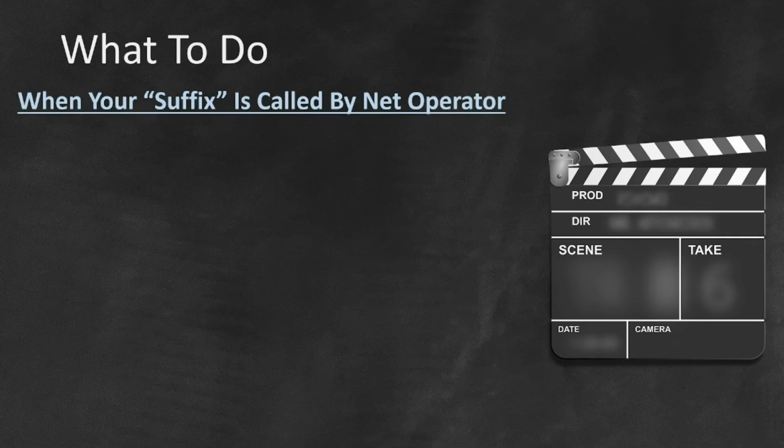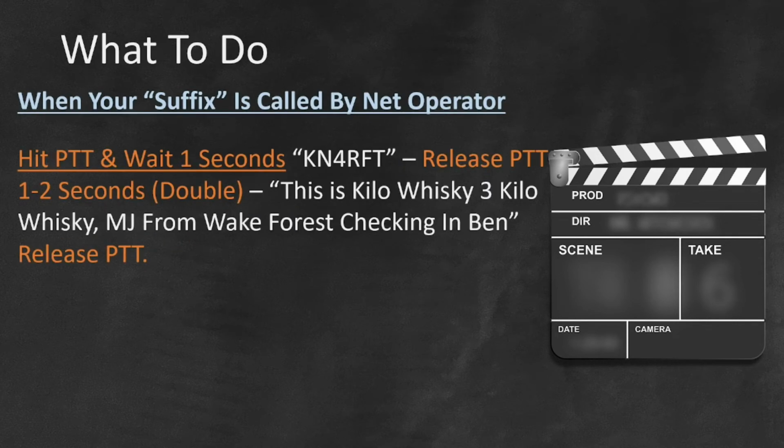So when your suffix is called, now it's time to get called in. Here's how you do a call in. So they're going to say, okay, Oscar through Zulu, and your suffix is T. It's your time. You're going to hit the push to talk. You're going to pause. Now speak. Take a breath. Talk. Because if you hit the push to talk and talk at the same time, it doesn't work. The first couple words are going to get garbled or not even heard. So to look like a pro, what you need to do, hit the push to talk, take a breath, breathe in, and then start talking.